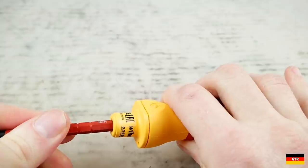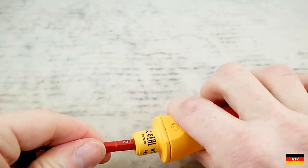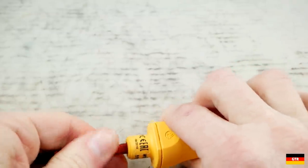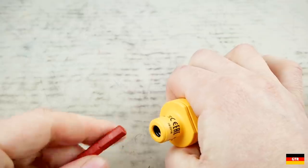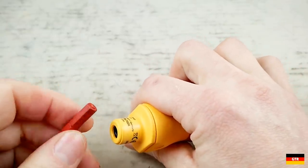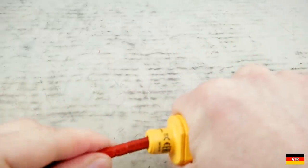Attempting to insert a bit, I find my first real issue with the unit. It can be quite hard at times to index these bits because there's no visual or tactile indication of the alignment of the bit. The other issue is that it appears the only thing holding the bit in is the friction provided by a small rubber o-ring just inside the holder. I think that is why there's quite a bit of play in the bit itself, and I feel like this o-ring will eventually wear out over time and there will be nothing left to really keep it in place.